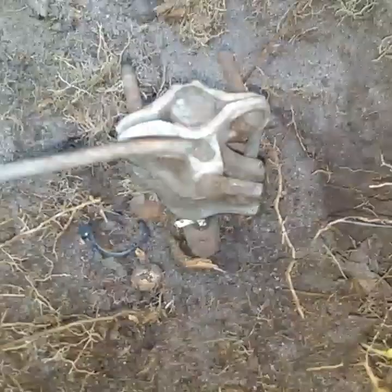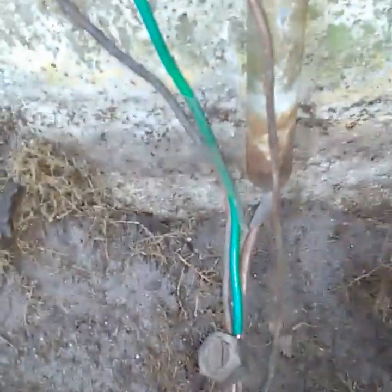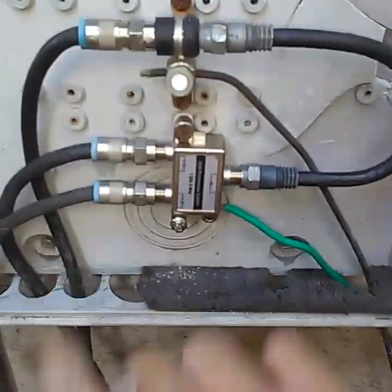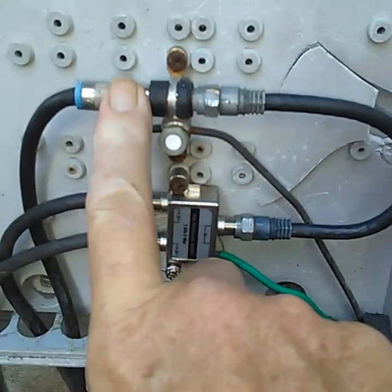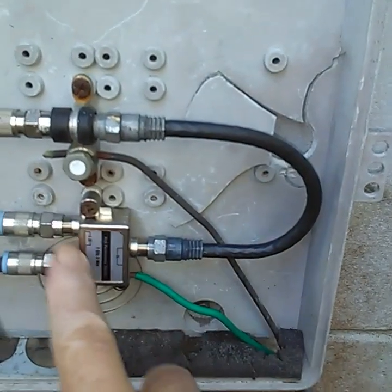This is a very old house. The deeper I dig, the more lugs I find, so there's no more room on that rod for me unless I excavate or add another — which I won't do. Here is a number four or number two wire that comes off the electric meter. If we follow this green copper wire, it goes up to my grounding blocks. Here's where the antenna feeds in — the main feed from the antenna goes to a grounding block. Here's a copper number eight wire that feeds around into a splitter.